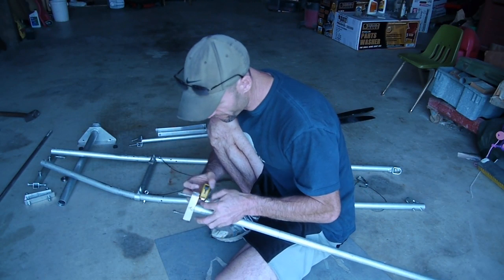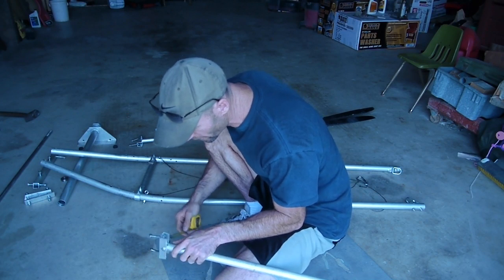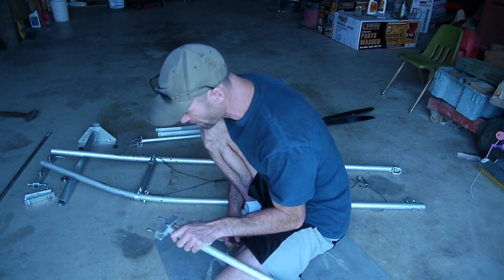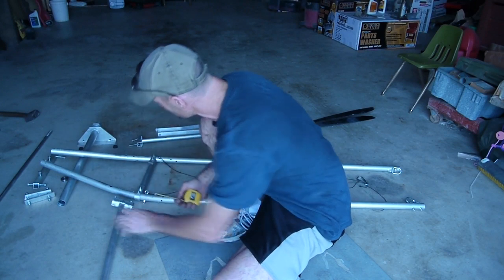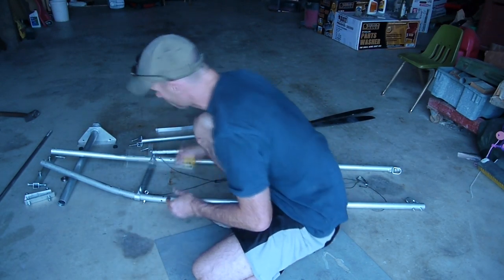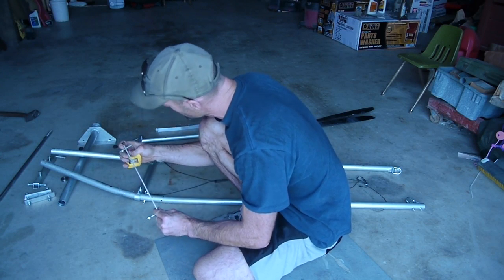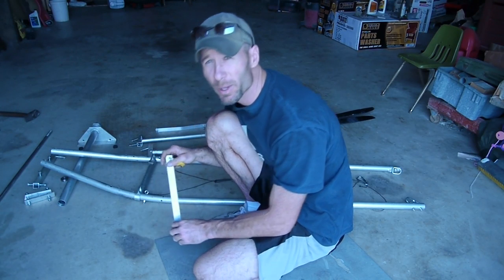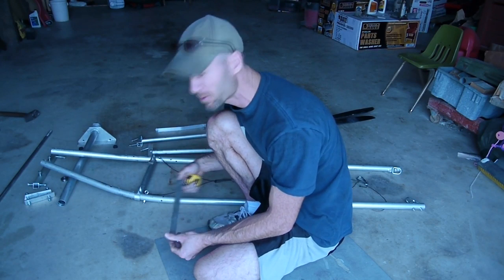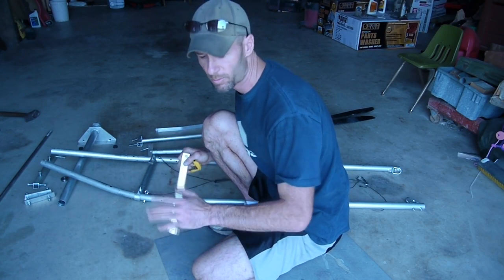The brackets up here are inch-and-a-quarter square tubing where I cut off the bottom portion, cut them about 3½ inches long — those are the leg supports. This inch-wide, eighth-of-an-inch-thick aluminum will hold the legs in place. I'm going to make these as trainers so that buddies who haven't flown powered harnesses can learn without messing anything up. They're going to fly with the legs down — I don't want them to have to mess with pulling the legs back.